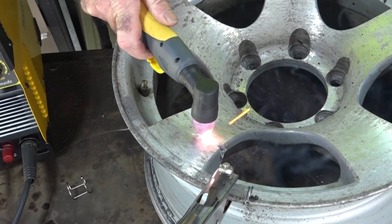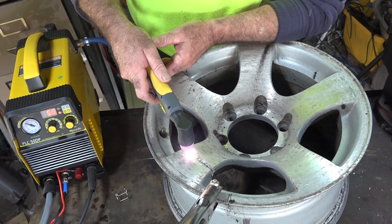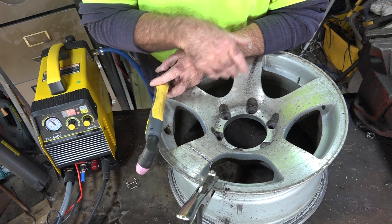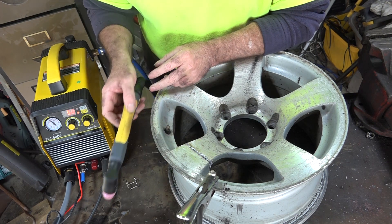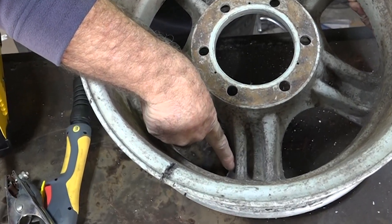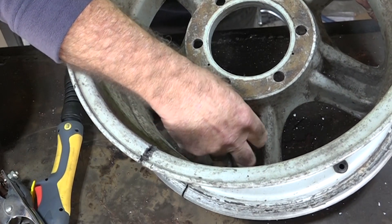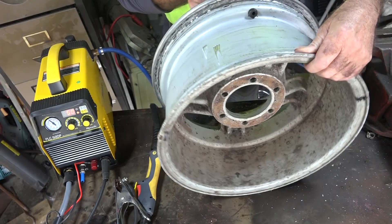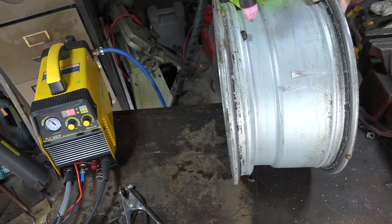Now I can't even seem to penetrate right through it. I'm running this on 240 volts too. I tell you what it does do — it spits up a lot of stuff, I can feel it burning on my arm. Not like when you're cutting normal sheet metal. Sheet metal doesn't seem to blow the amount of stuff off that this is doing. Let's turn it over and actually see if we've made any impression on it. There's not much of an impression. Maybe 50 amps is just not enough. Let's turn it around and see if we can cut along the thinner part.